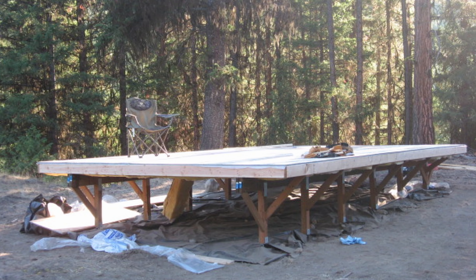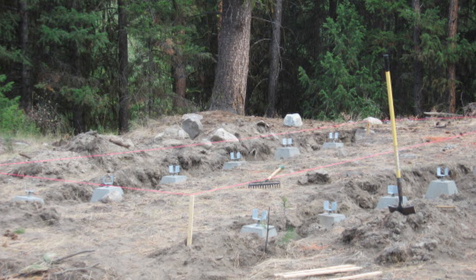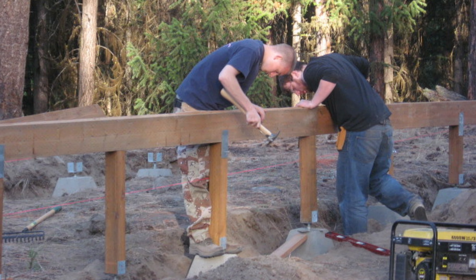The post and pier foundation is a fairly common type of foundation. You essentially set some kind of pier — that would be concrete blocks, or maybe a sono tube — drill a hole in the ground, typically below the frost line, pour concrete, then set a post on top of that pier, and then a beam, and build your house on top of that. It's a fairly simple and pretty common system.